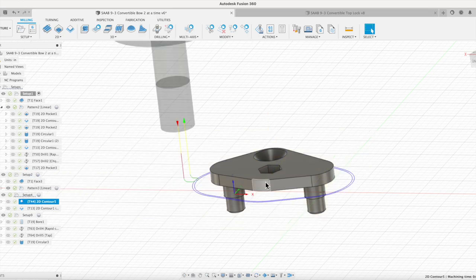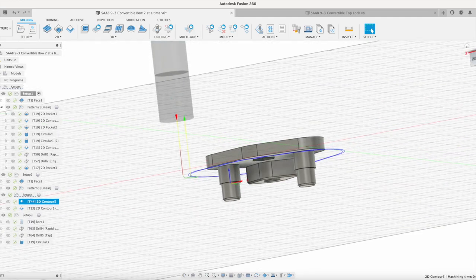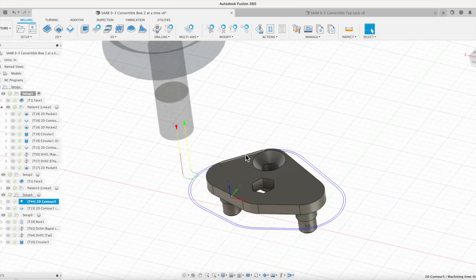And then for the next setup, we are going to bolt it into our jig plate. Remember, the jig plate is built around these two steps right here. We're going to drop it into that, bolt it in place where it sits flat. Got that bolted into the jig plate, and now we can easily hold on to it to cut our contour. So we've got the contour set up to work off of one of these holes. For the first one, we'll just line it up. It'll make all three holes.